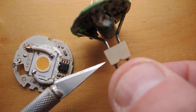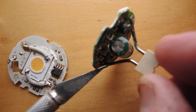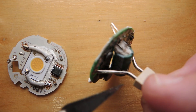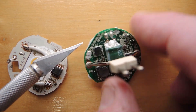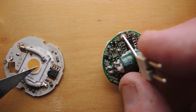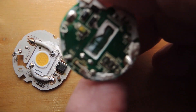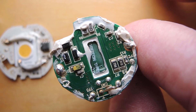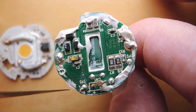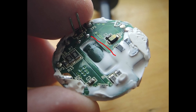With the epoxy removed, some clever engineering is visible. This is an MR16 — a really tricky form factor to design an LED bulb for because it's a constrained space. The design engineer put the connector at the very edge of the circuit board and tucked the electrolytic capacitor in the middle. On the circuit board we can see a couple of inductors — this is a boost topology. This assembly was being fed with 20-plus volts. There's an integrated circuit on one side, and on the top we see some discrete components associated with the power supply, plus the connector going up to the LED assembly.